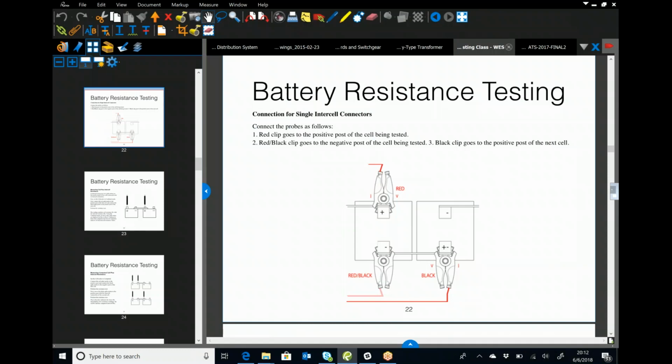Yeah, and in the sub world, you guys are working on pretty big battery systems, very large jars. This is still something that the NFPA has wrestled with for years. You get in front of a UPS battery cabinet or a station service battery rack, you can't go through and torque and take most of the readings in a 40 cal suit. So they've kind of stayed away from it on the arc flash side. I know that is changing, and it's changing rapidly.